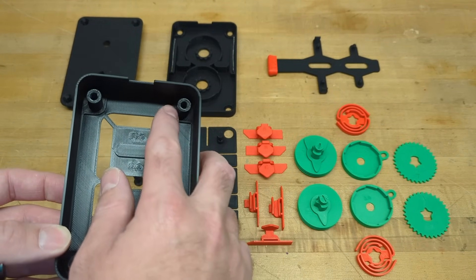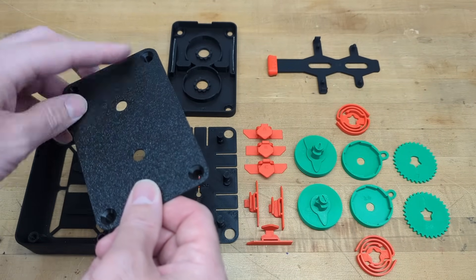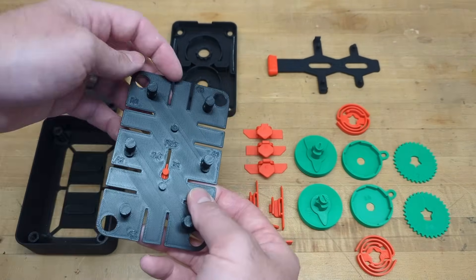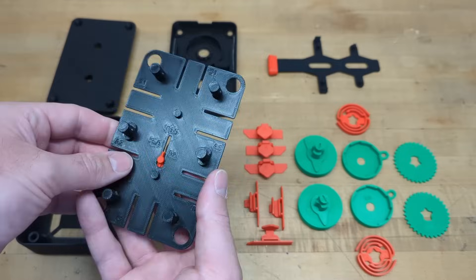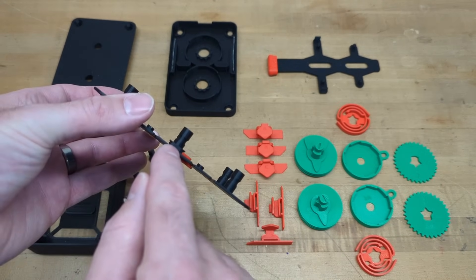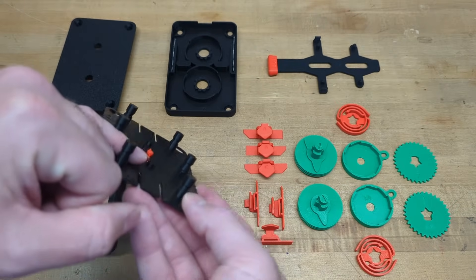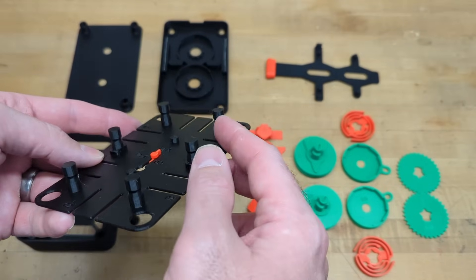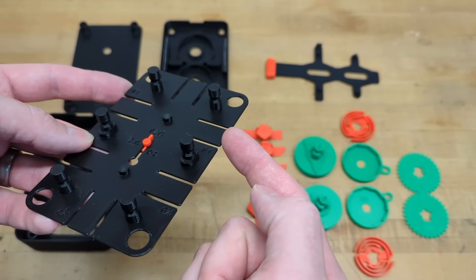A little support has been added around the base of the screw shaft to help support the seg plate. The back plate has countersunk screw holes that go together with the new countersunk screws. For the seg plate, there are a few changes: first, dual guide paths for the segments. The D segment or center segment now snaps into place so it doesn't fall out. There's now a dedicated D segment rubber band location, and the height of these extrusions has been increased for greater support of the D cams. Six pegs have been added to the seg plate as a guide path for the rubber band.